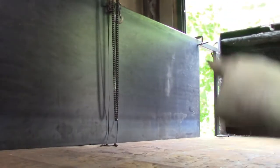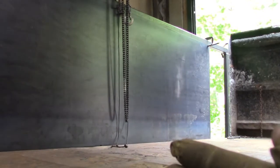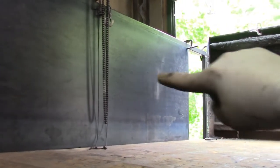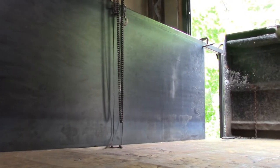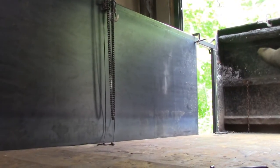And on that vertical post back there, when the other sheet, this sheet's not long enough to reach all the way to the end. I can only buy this in 10-foot sheets. It's a 12-foot body, so I've got to cut two filler panels that are 2 feet long for that up there, and that's the sheet of material that's right here.